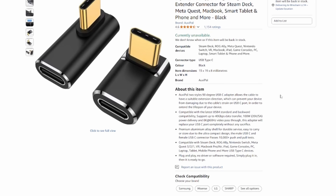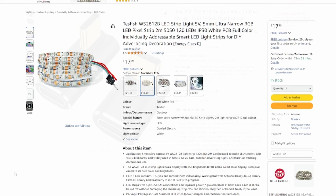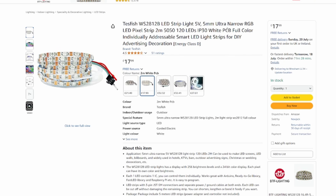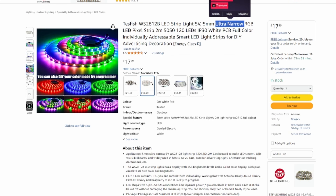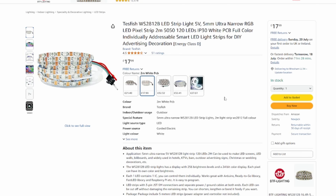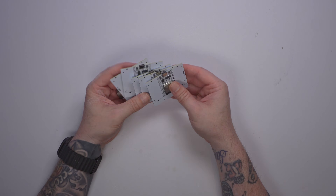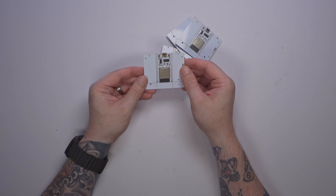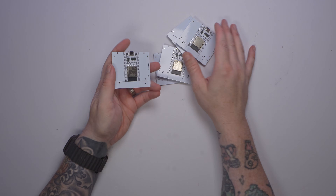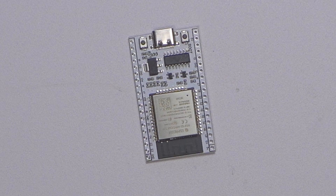You can use a USB-C cable that has a right angle on the end and just use that cable instead — I know some of these are out of stock, but I'll find other links in the description. Next, if you're going for the RGB, you're going to need those LEDs. These are ultra-narrow and a little bit more expensive, but you don't need to use these specific ones — I got these for the PS2 Classic project and I've used them again for the Switch 2 dock video coming up. You can just grab any sort of LED light strip as long as they're addressable. Of course we need something to power that RGB, and we're going to be using these custom-made ESP32s I ordered from JLCPCB — they're perfect for WLED and any LED RGB project. I've got a dedicated video on them; click the top right-hand corner to check that out.